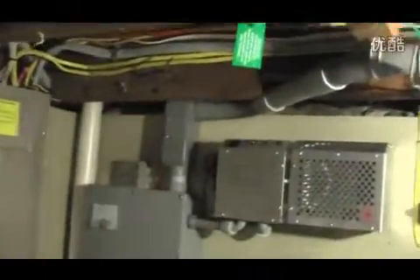I wanted to show you what I did with the fusing coming in. I had that same conduit but I rerouted it — it's actually an inch and a half; I stated in another video that it was two inches. I put this box in, and in this box is where I put my fusing for the unit. Each of the three phases has 100 amp fuses. It turned out pretty good — it leaves me enough room to set another one over here, so when I have my second turbine on the house I can bring everything in through that and do the same thing.